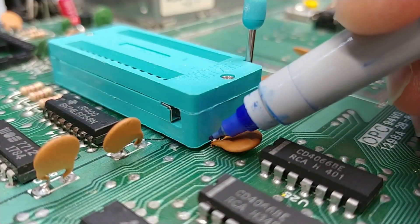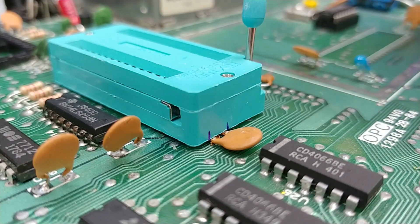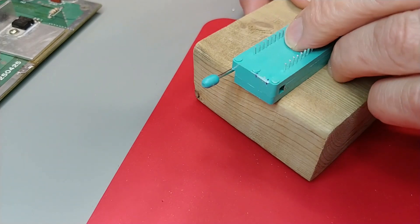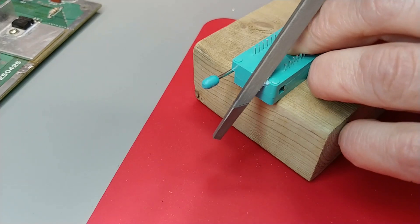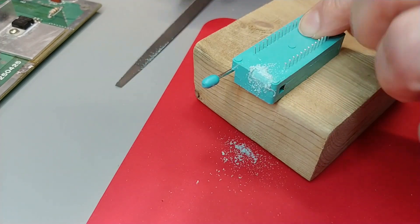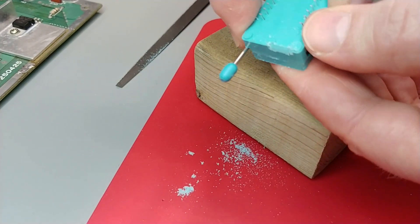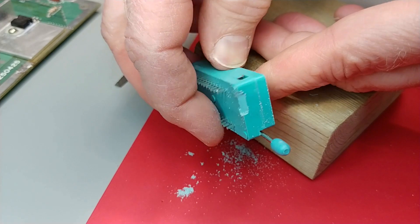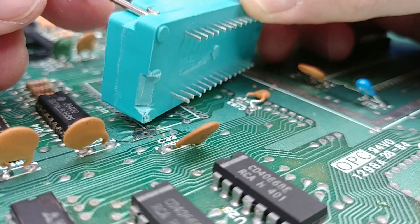The file is out, the ZIF socket is marked, and what I'm going to do is carefully file in between where I've marked. And that was actually easier than I thought. Hopefully I've made enough space so that capacitor will fit through there and the ZIF socket will mount nice and flush against the surface of the motherboard. Here's our completed reshaped ZIF socket — looks pretty good.